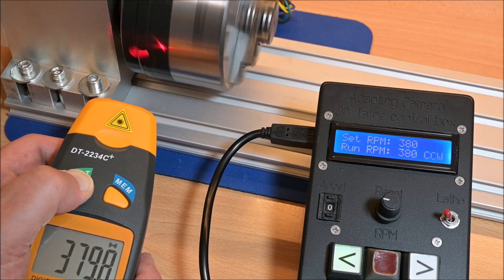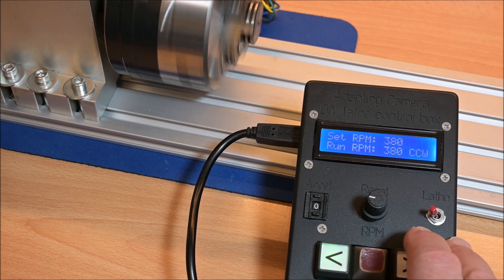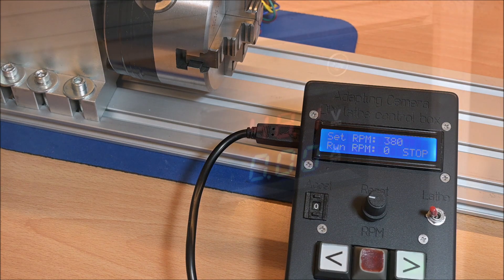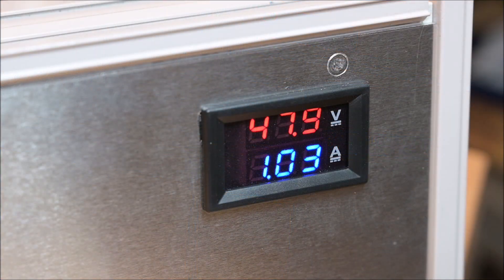This is what happens when the emergency stop button — the rotary encoder push button — is pressed: the rotation stops extremely fast, even at the highest speed. Current use is moderate, about 1.5 amps maximum without any load except the chuck itself, so there is a good margin before the PSU is overloaded and before the maximum current of 3 amps for the stepper is reached.